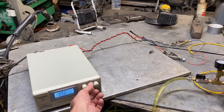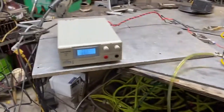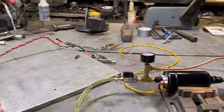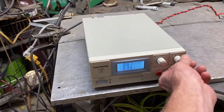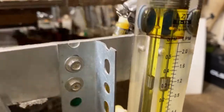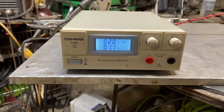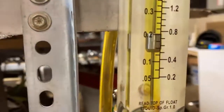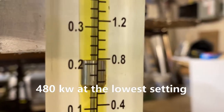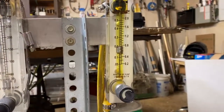Let me show you that it does give superb control. I'll turn the amps all the way up — we're at 6 amps, 12 volts. I'm going to turn the voltage way down; you can hear the pitch going down. Okay, so we're at two volts, and as you can see we're getting a pretty steady flow right there. There is almost no undulation in that flow.